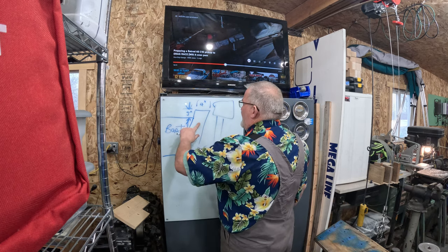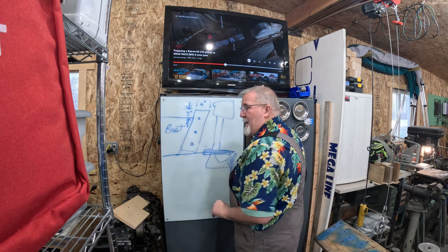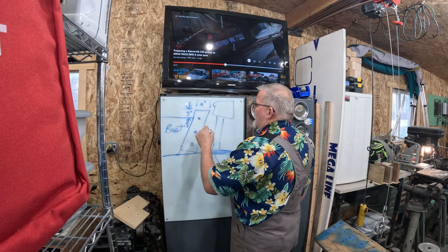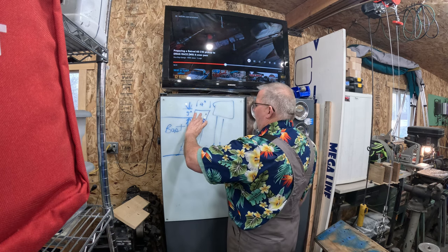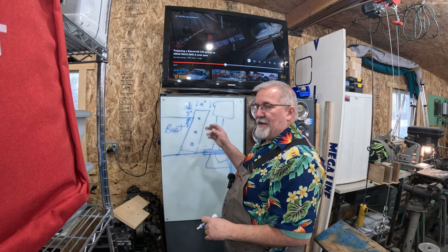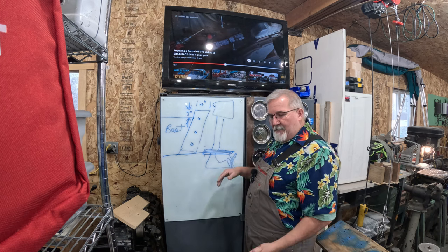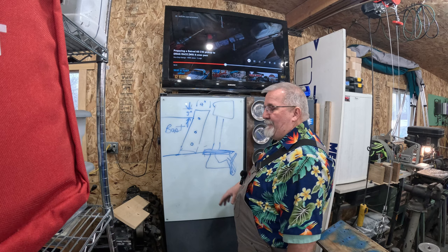I currently have 3 bolt holes on mine so that I can raise this up, like you're going to see here in a second, where it's locked in here. The outboard's mounted up here, and I've got what I'm going to call perfect placement down here. And if you move from this set of holes down to here, which brings this whole jack plate down 5 inches, then I've got it set up for short shaft. It may be just a touch deeper in the water than it needs to be when the outboard's hanging on it, but that's fine, because a touch deeper is way better than a touch shallow, because you don't want any cavitation.